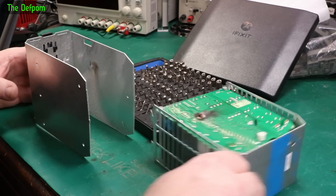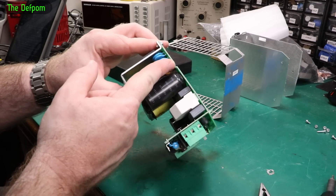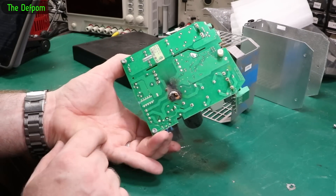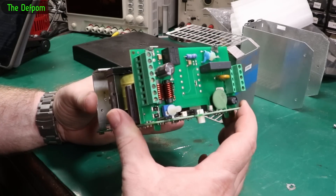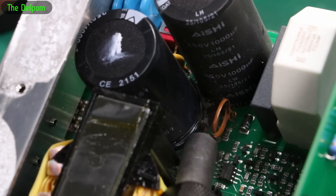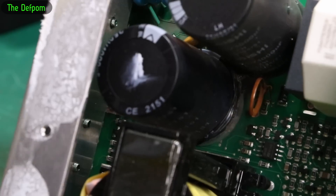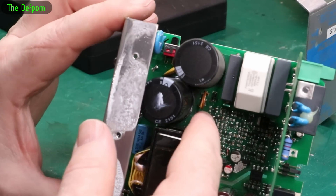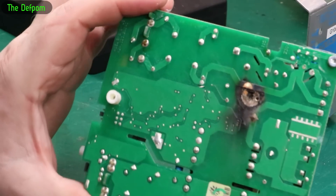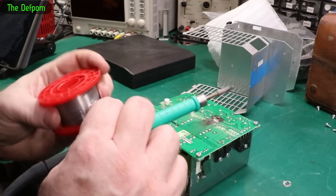There's a bit of a witness mark. Just a quick visual inspection — there's a switch here for voltage selection that is set to the correct voltage. In our country it's 230 to 240 volts and it's set to 230, so that's fine. So we obviously have this catastrophic explosion over here, which is a capacitor which has also extruded off the board, and right next to it is what's left of a PTC. You can see that has exploded and disappeared, and that capacitor should not look like that. So that's had quite a surge go through there. Now you may find that we can fix this — replace that capacitor and maybe replace the fuse, and it might start back up again if there's no other bad damage. Obviously we've got a hole through the board but that's not a big deal — we can fix that. So I'm just going to desolder this cap and see what we can salvage from it.